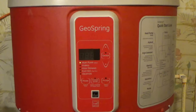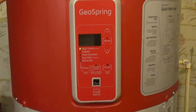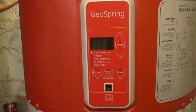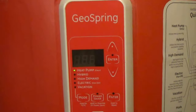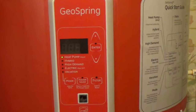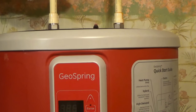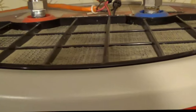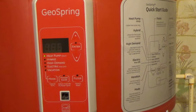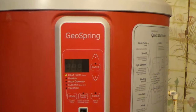I'm not sure if I've shown this in the past — I don't think I have, actually. This is my water heater, and I think you can hear it running. It is a heat pump water heater, and it's on heat pump mode. It's kind of like an air conditioner that runs backwards — it puts the heat inside the water tank and the cold air is evacuated out of the top. It's really, really cool and incredibly efficient, especially if you keep the filter clean. I've had this thing for probably two years and it has absolutely reduced my energy bill a lot.